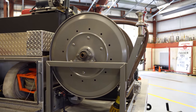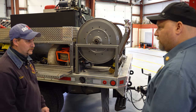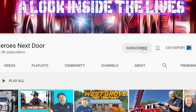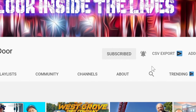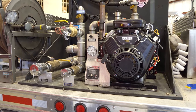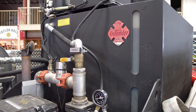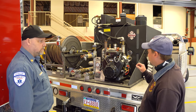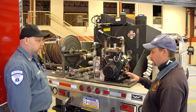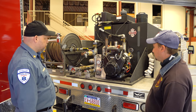As we make our way back, there's a hose reel here — this is all pre-connected. It's 100 feet; all the firefighter has to do is pull it off, the pump operator opens the valve, and he has water at the end of the hose. Let's step over to the other side. This is a lot of stuff connected to an 18-horsepower motor. The tank holds 400 gallons of water and we also have five gallons of foam. You've got an inlet, a couple of outlets, plus your pre-connect.